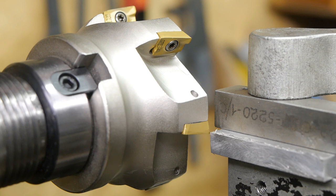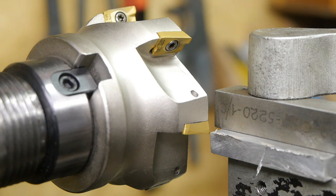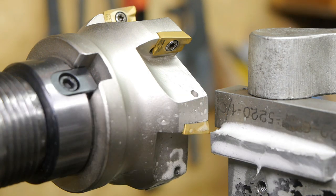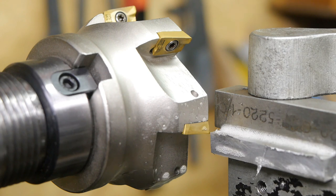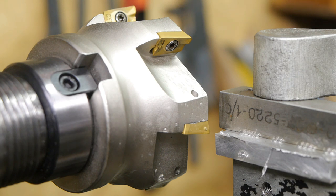I am great and this video will be great. Alright, I thought we'd start with some aluminium — this is a scrap of the same stuff I used for making the camera quick release plate. Fly cutting that worked better than expected; I almost got a mirror-like finish. Some WD-40 to prevent the aluminium from sticking to the inserts, and I'm going to run the lathe at top speed — a whopping 600 RPM. According to an online calculator I used, I could run the lathe spindle three times as fast. I'll put a link to that calculator in the description.